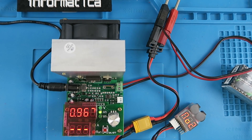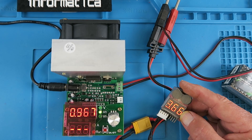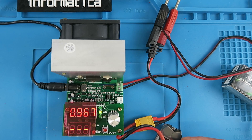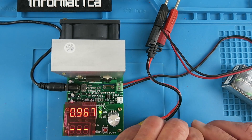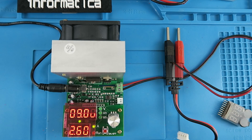Things happened more quickly than anticipated — at only 967 milliamp-hours the alarm went off, meaning the voltage dropped under 9 volts. It has bounced back now that the unit has disconnected. Cell readings are 3.66, 3.29, and 3.68 volts. This battery pack is performing well under its rated 1300mAh, and it's quite warm to the touch — clearly time has taken its toll on its capacity.